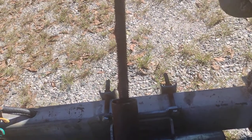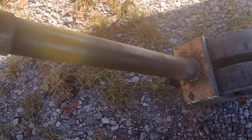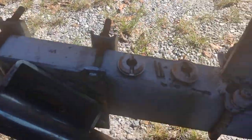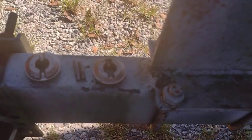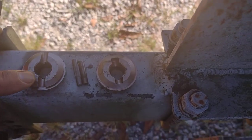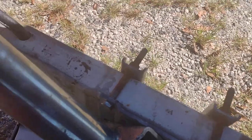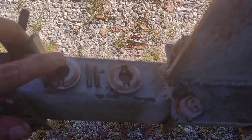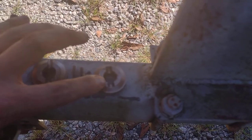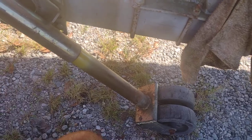Start working it in and out, and it should be good to go. We've got the shaft back in the housing. In the kit it comes with two gears and two pins. One gear has a slot going all the way through where the other does not — the slotted gear goes on the screw part here. The pins have two different lengths: the longer one goes with the longer slot, and the shorter one goes with the other.